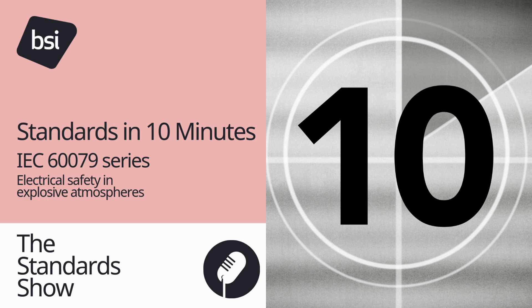Number four: why the IEC 60079 series is important. A light switch may cause a small, harmless spark when switched on or off. In an ordinary household, this is of no concern. But if a flammable atmosphere is present, the arc might start an explosion. In many industrial, commercial and scientific settings, the presence of such an atmosphere is a common, or at least commonly possible, occurrence. Protecting against fire and explosion is of interest for both personal safety as well as reliability reasons. In coal mining, for example, there are risks that coal dust can explode as a direct result of the ignition of flammable gases such as methane, by either blasting, drilling, the use of machinery or through faulty equipment. The use of international standards can help ensure best practices are followed and so help to reduce these risks.